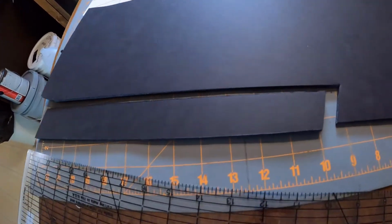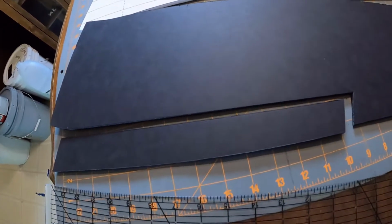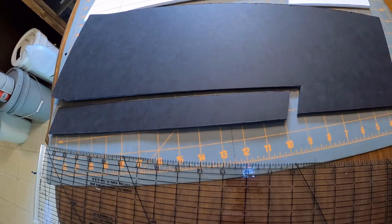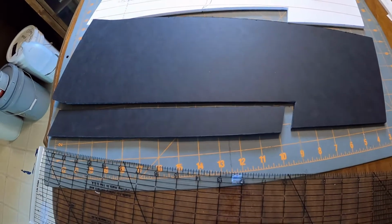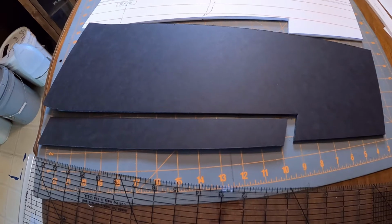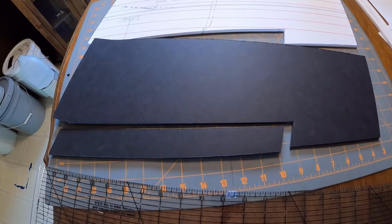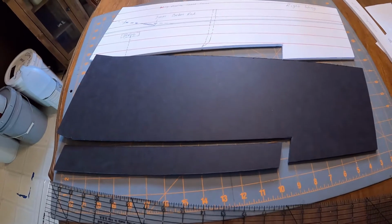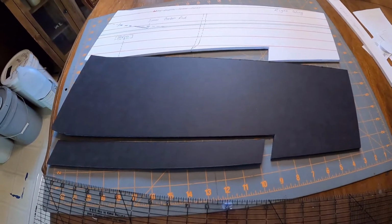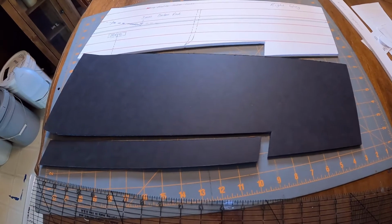Okay, this is going to be a flaperon. So it's a combination of flaps on the inboard side, aileron on the outboard side, but the whole surface moves at the same time. If you put a mixer in here, they call it a mixer, you can either run both sides down to make flaps, or you can operate them up and down individually as ailerons in flight. So what the mixer does is still allows you to have ailerons while the flaps are down, so you can steer the airplane for landing. So even though the flaps are down, you'll be able to operate each one independently to adjust wings level as you come in for a landing.